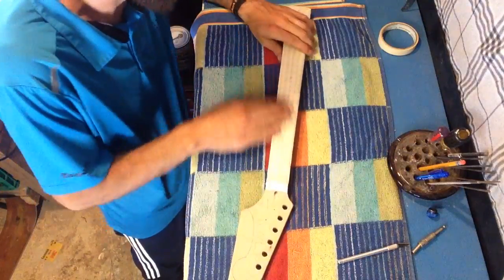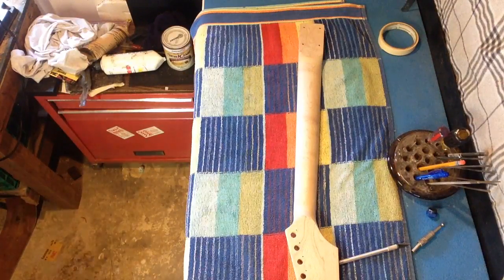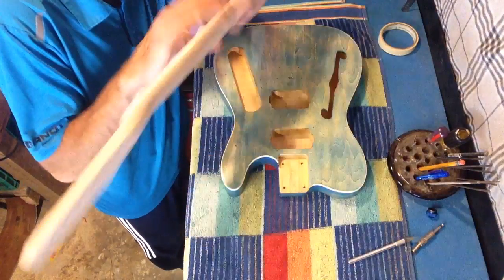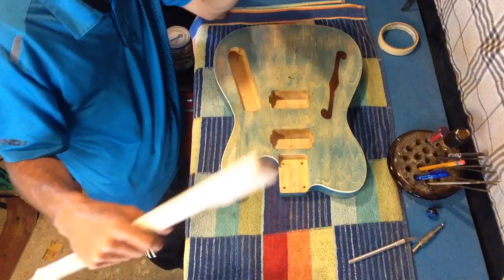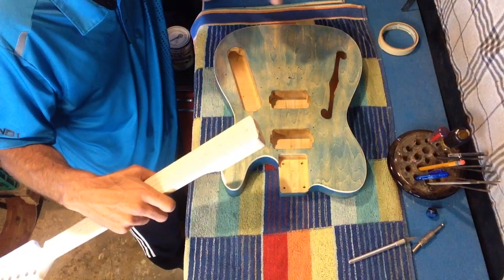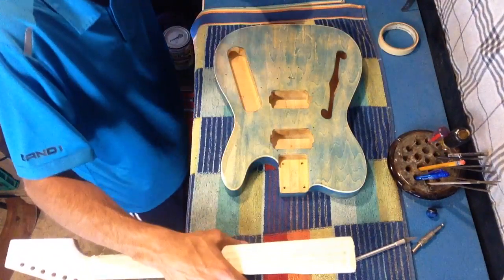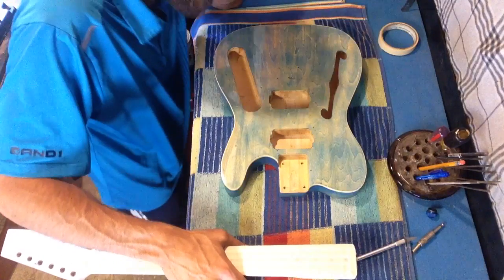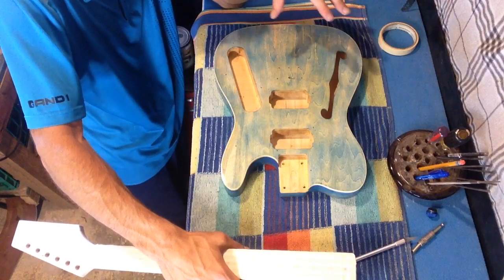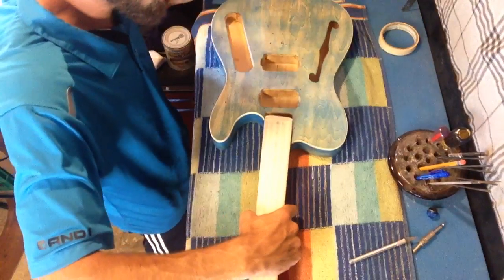That's why I say again, this is great for first-time builders, because of the stuff that you mess up that causes you to have to start over from scratch. Get these screws wrong, get this pocket routed wrong, cut those screw holes wrong where the bridge goes, get the screw hole alignment off, not know how to measure out for those things, or how to make templates for those things. Even if you buy pre-made templates and you're using raw wood, you've got to know how to line that up, right? So that's why I'm saying you have to be flexible in some ways, and in some ways the things have to go a certain way.